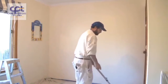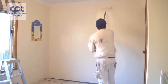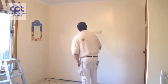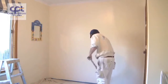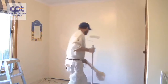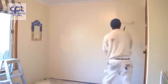So now I've got to here — that's pretty much just repeating the same process. Once again, about half a roller width away, spread the paint out. I haven't got quite as much on this dip. Just move my roller tray. That's another handy tip too — always have your roller tray close by and not on the other side of the room, like I've seen some people do.